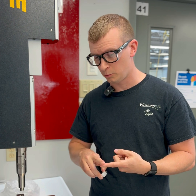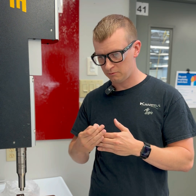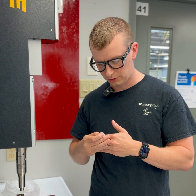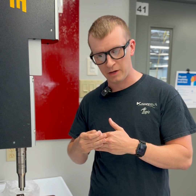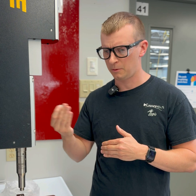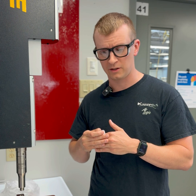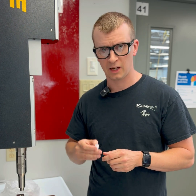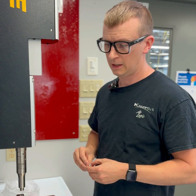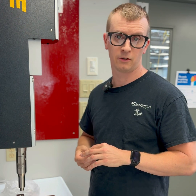But if you're putting a different fluid through there — that could be lubricated air, that could be water, that could be a chemical — it's going to get in between all the components inside the check valve. When the check valve goes to close, there's going to be a little bit of that fluid left there, and that's going to impact how much the check valve wants to stick or not stick closed. This isn't such a big deal at higher pressures, but when you get to lower pressures, especially under one psi, those little sticking forces actually do add up and will impact how much it takes to open the check valve. So I'll encourage you to test it in your application with your fluid and see if you get different results in air versus whatever fluid is going through your system.